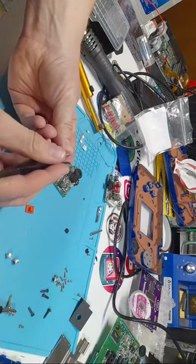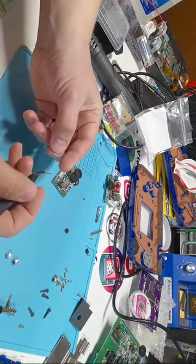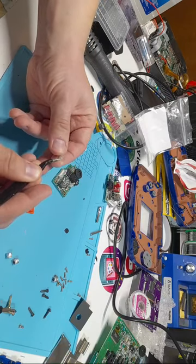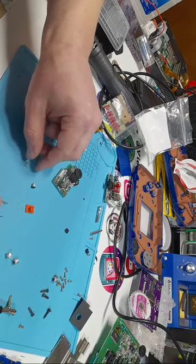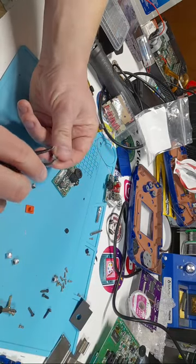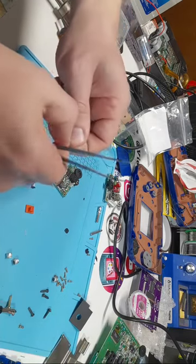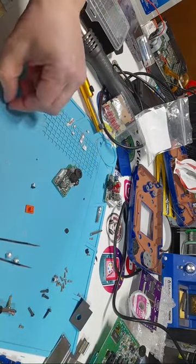Okay. These capacitors are a bit of a pain to get out. These are tiny. Come on, open up. So the good thing about the ceramic capacitors is that they can go on either way. There's no right and there's no wrong. When the electrolytic ones, you have to put them in the right direction. We'll get into that in a moment, though. If this thing would just get out of the package, though, there's one. Okay. Glad it didn't, like, yeet it across the room or anything, as the kids say. Okay, and there's the second one.